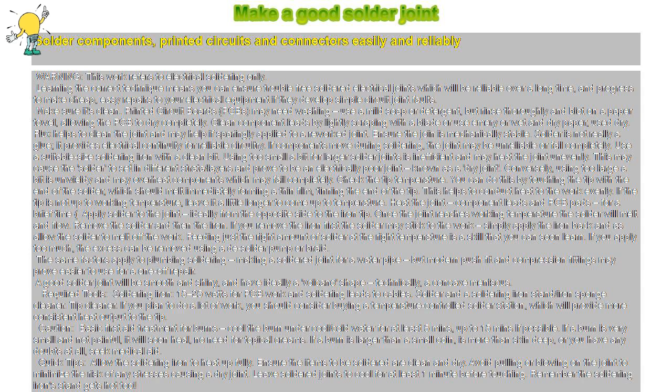Make sure it's clean. Printed circuit boards, PCBs, may need washing. Use a mild soap or detergent, but rinse thoroughly and blot on a paper towel, allowing the PCB to dry completely. Clean component leads by lightly scraping with a blade or use emery or wet and dry paper, used dry. Flux helps to clean the joint and may help if sparingly applied to a reworked joint.